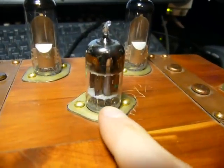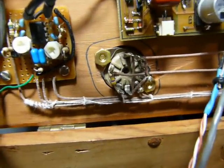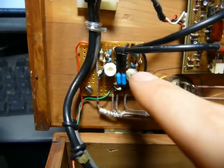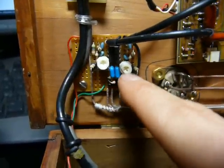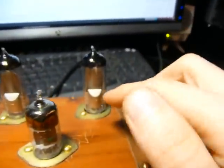If you really wanted to, you could take this out and put in another one of these, but the audio characteristics aren't very good — it's not meant for anything other than display. Here's the driver circuit that I whipped up to drive the grids of these tubes. It's very simple. The audio comes in off of here — you see these two cables plugged into the circuit board — they tap directly off of the stuff that comes out for the headphones. They go into this op-amp, and basically it's just a bandwidth-limited, non-inverting amplifier. That's it. You've got these two potentiometer trimmers here — they control the gain of the circuit. And these capacitors provide bandwidth limits so that if your audio signal goes loud, soft, loud, soft, these won't react at the same speed.